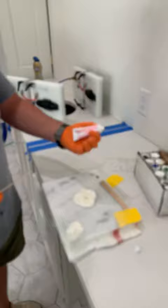Those are our seam setters. I'm mixing the hardener in now and just filling the seam with it — there's about an eighth-inch gap in it right now. We pack it, then I pull the tape off, put the seam setters on, and adjust the two stones to get them perfect with each other. I cleaned it up and that is the finished product. It has virtually gone away, and that's how you turn two pieces of stone into one piece of stone.